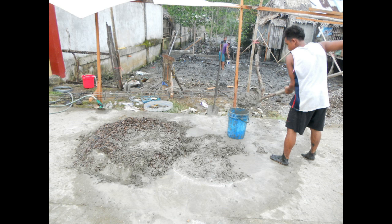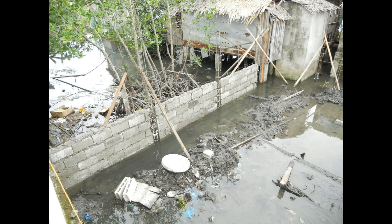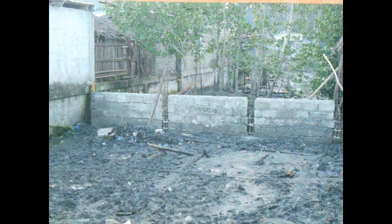The block wall itself was rebar reinforced, filled with concrete with a waterproofing compound made by Sahara added to the concrete mix, which helps keep water from permeating through the wall. The columns spaced along the wall are poured with four 12-millimeter rebar tied together with what they call stiffeners or rings.